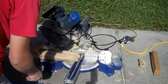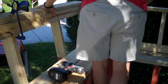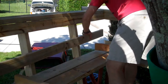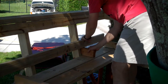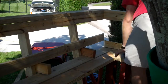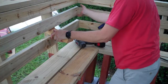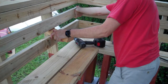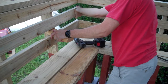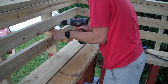The top backrest board is easy to mount, because you can just clamp it up against the top board. The bottom backrest board is supposed to be mounted 3.5 inches above the seats. Anytime a plan says something is supposed to be 1.5 or 3.5 inches away from something else, they are telling you to grab some scrap 2x4s and use them as spacers. Unfortunately, the spacing on the middle backrest board is 2 inches. I just drew a line on the upright and used a clamp to hold the board to that line.